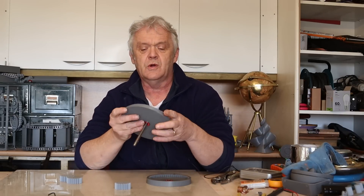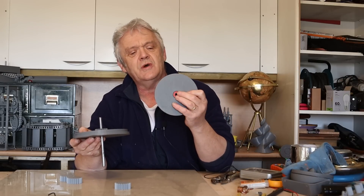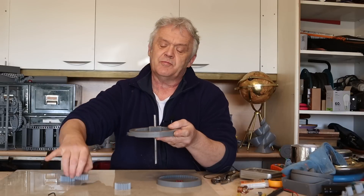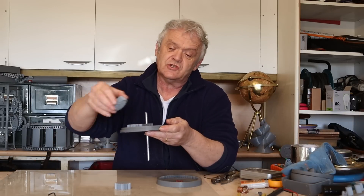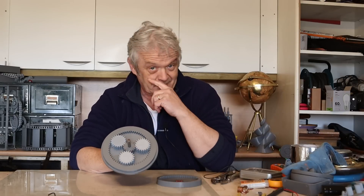The central drive goes through and I've put two bearings in there — they're skater bearings, so they're 22mm by 8mm by 7mm thick. Pop those in there and the planetary gears go in, as you would expect any planetary gear to go in, at 120 degrees apart.